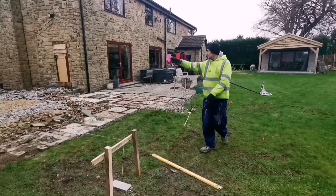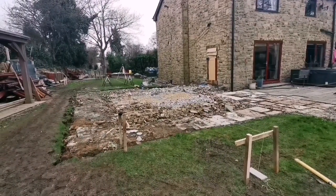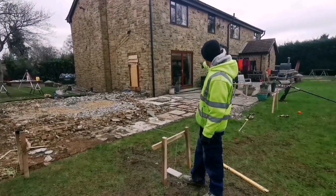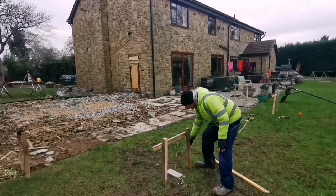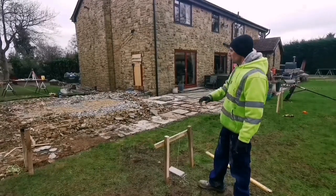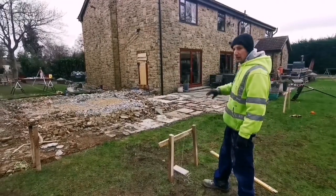one. Slack a bit, but you can see it now. So from there to there and then back. So what we want to do now is we need to get us level. We're over here, measure that floor, take a level front floor, we'll mark it on each of these, and then we'll set us plate up, and then that will be as floor height and as damp proof height, and then we can take all those measurements from that. And then we'll just spray it floor with a can of spray. And we're ready for digging.